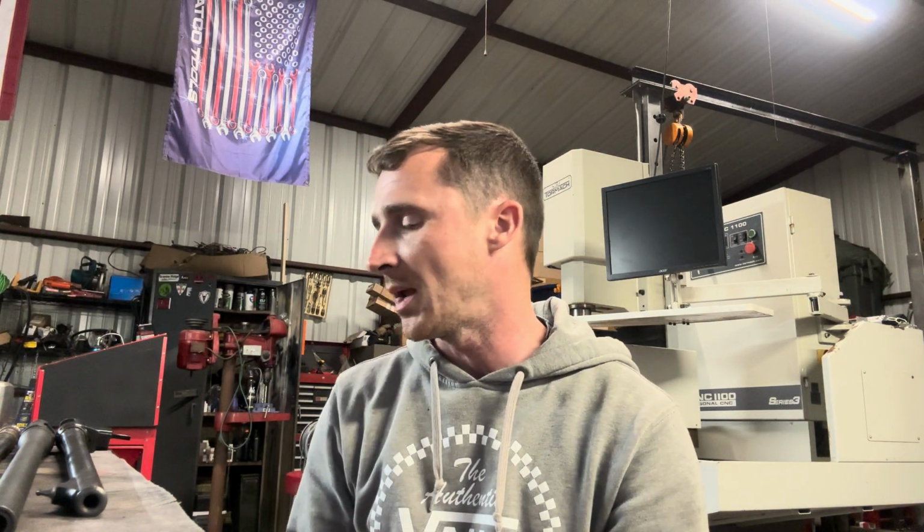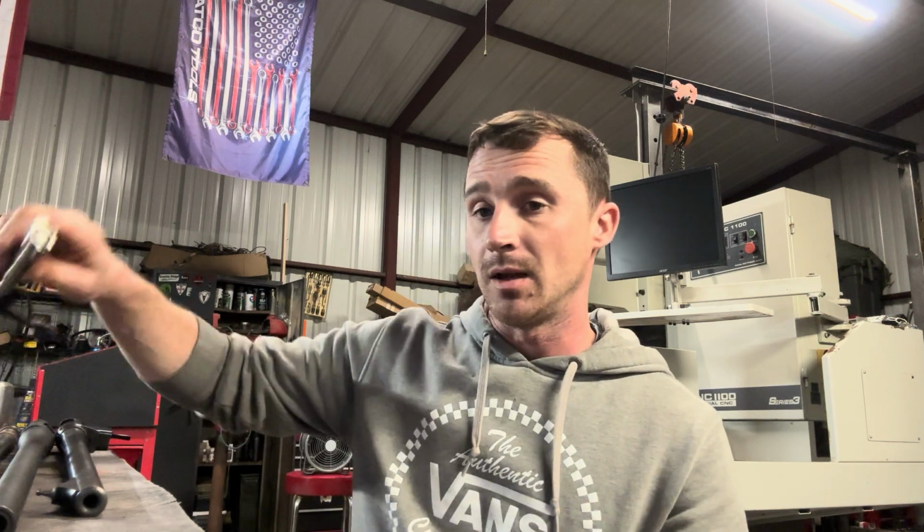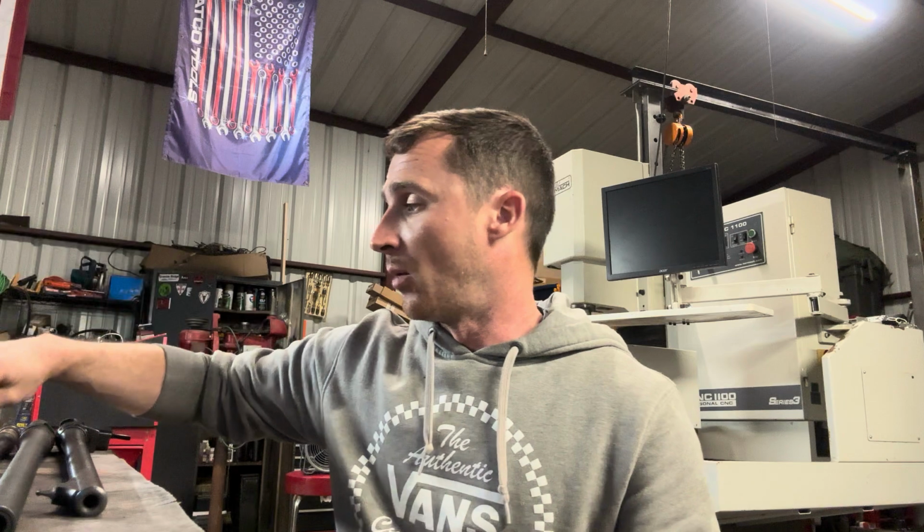But when having these conversations with your gunsmith, it is worthwhile noting what the action is and what the replacement barrel is going to be. So on a Mauser style action, somebody calls me and says, "Hey Dylan, I'd like to rebarrel this Mauser that I have." I'm going to ask you what Mauser it is, because there were several of them in several different designs made in several different countries, with several different thread pitches over a huge span of years. They still make Mausers, or the Mauser brand is still in existence. And so I want to know what it is, what caliber it's in currently, because the bolt head diameter is important, what caliber you're switching to, and then which barrel setup you're trying to use.